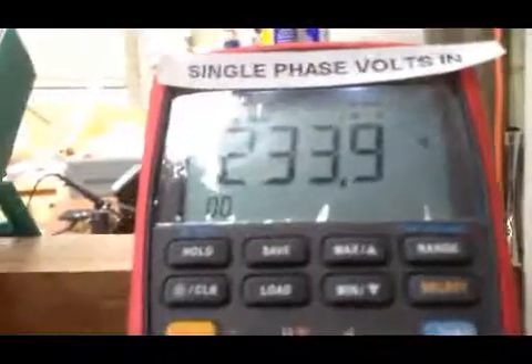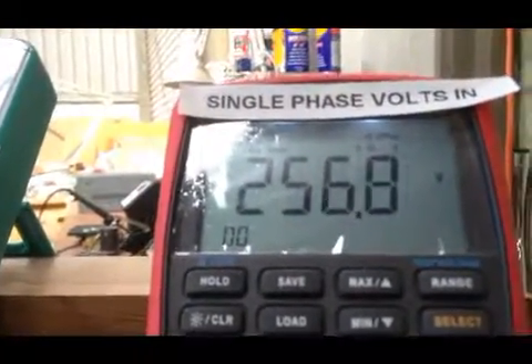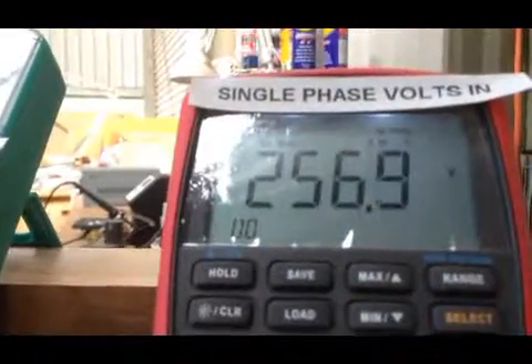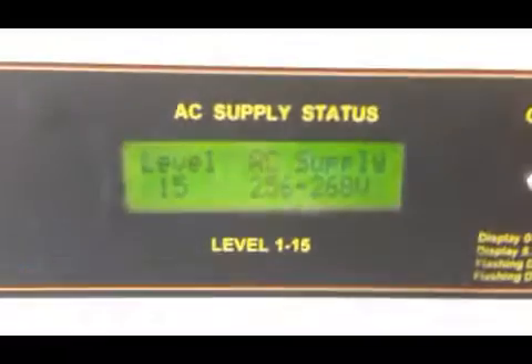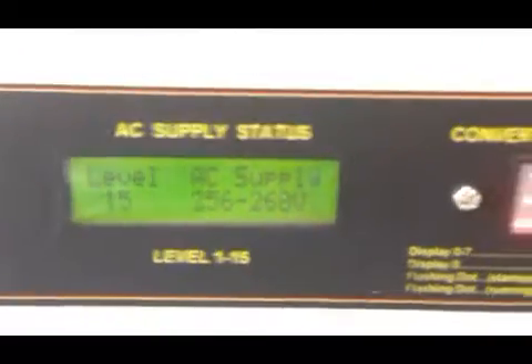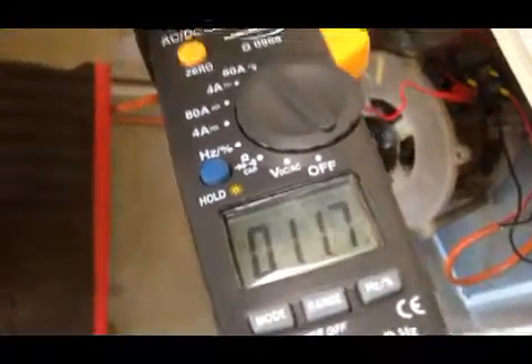Now I'm going to move the voltage on the variac up and down to see what happens. Pushing the voltage up — we might have an over-voltage condition. Normally the converter would follow the over-voltage. I'm getting about 260-odd volts going in, which is quite high, and the output voltage is still at 400 volts. The display is jumping between level 15 and level 14 — right on the border, but the converter's still running perfectly fine. Because the voltage has gone higher, the input current has actually reduced to around 11.7 amps.